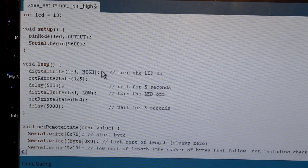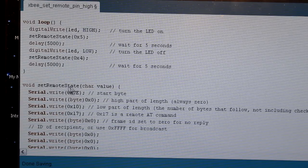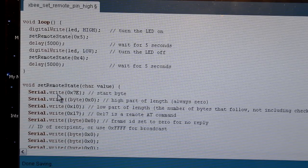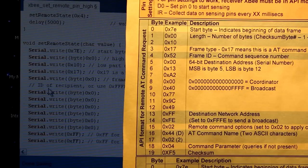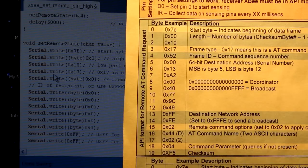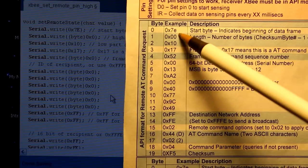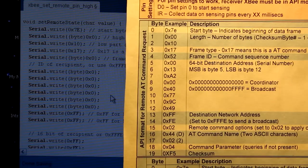Keeping it as basic as we can, let's look at the function now. Here we have void set remote state with a char value parameter. I hope you understand how API frames work from the earlier sessions, because now we're going to be actually building an entire frame and sending that to the XBee to be interpreted. I moved the quick reference guide into the frame so you can see both at once. First we have to indicate this is the start of a byte, so we write to serial 0x7E — 7E indicates the start of the frame. The XBees are very particular about how they accept the frame; it needs to be in exactly this precise format.